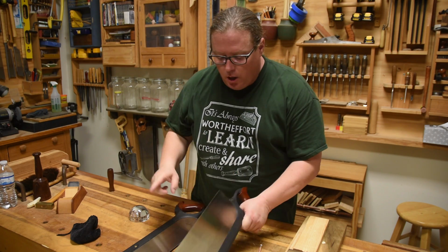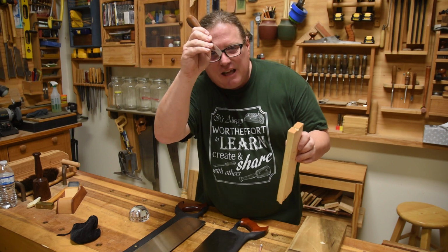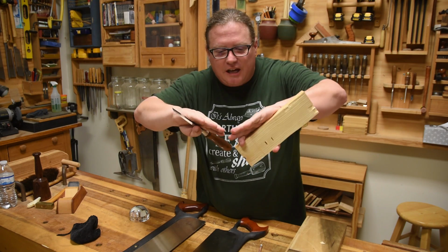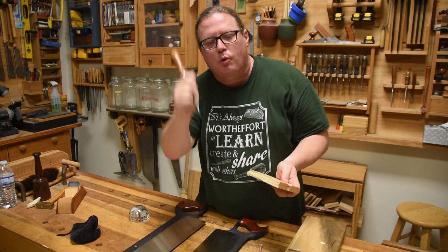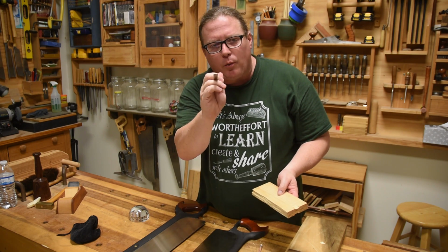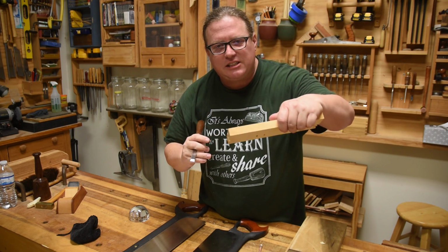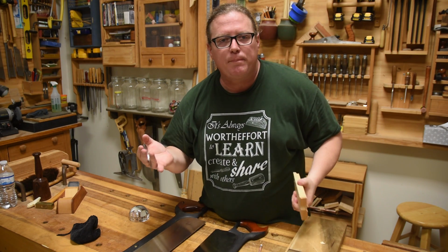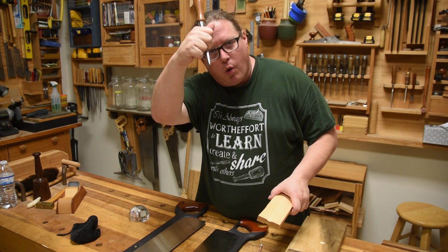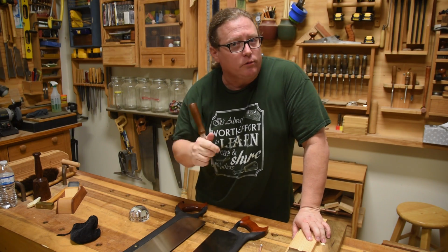Because if you remember, when we put the chisel's point on with the grain, yes, that first cut indented it, but no wood was coming out, and we were just pressing it down. And each subsequent cut, we didn't get much work done. But when we turned it sideways, it was easy to get a lot of work done. But when we did that sideways action here, it just destroyed the board, ripping it apart. Whereas we got nice clean cuts going on the corner of the chisel. So, let's see if it works like that in the real world.